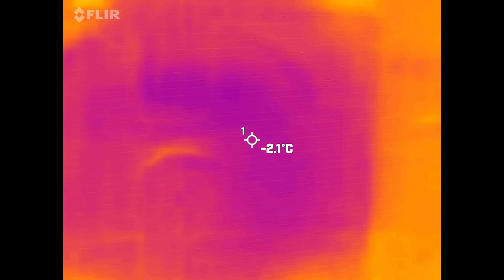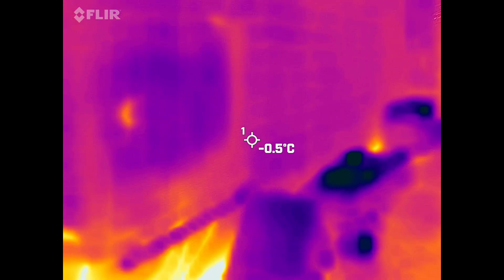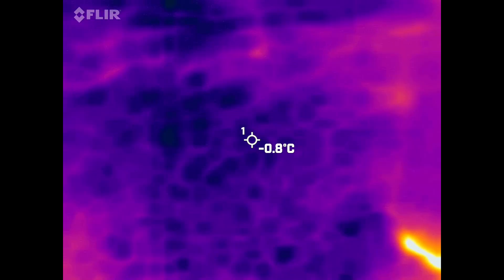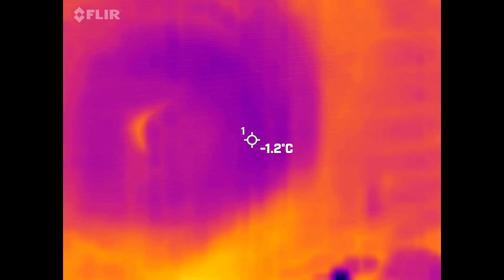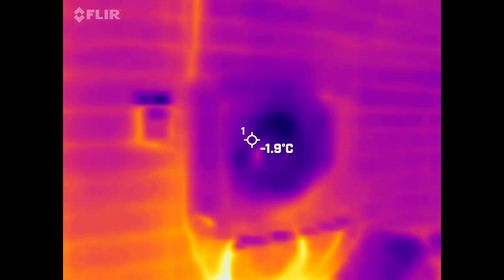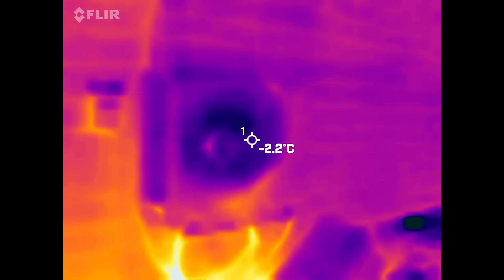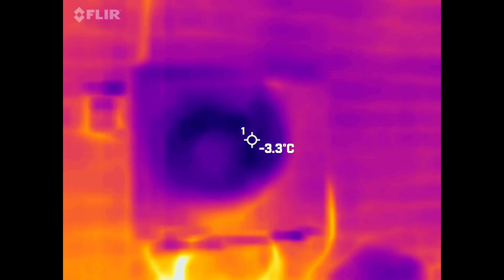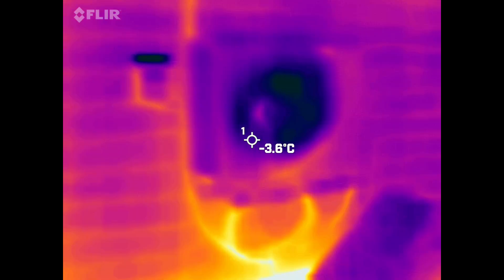The cold air is blowing. I don't know if this is picking up the correct temperature or not, but right now the outside is 17 degrees Fahrenheit — around the coldest nights it seems like it's showing negative one. It's almost unbearable keeping my hand next to the fan. You can see that blue blob there — that is the outdoor condensing unit on the Mr. Cool 24,000 BTU two-ton unit, and it's warming up inside to 82 degrees Fahrenheit. It's performing good so far even in this cold weather.